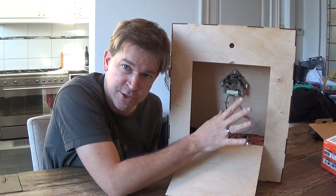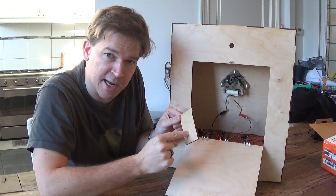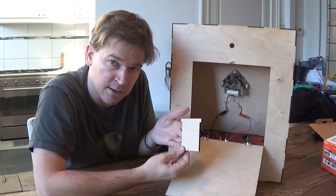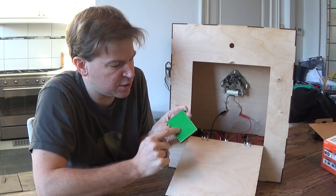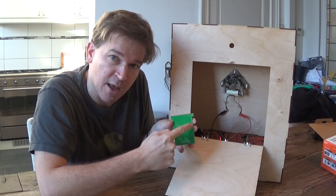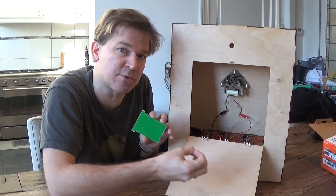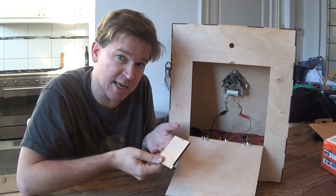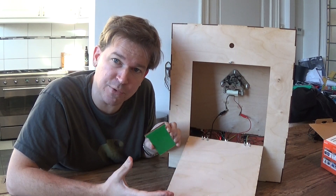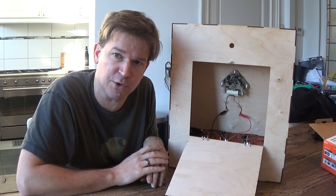Every slit has two sensors. First is a simple light barrier — the moment a key is put in, light is blocked to the sensor, so we know a key is there. Each key also has a little magnet, and each slit has a hall sensor that detects the magnetic field at the location where the magnet should be. That way we can detect if the right key is in the right slit. We visualize everything using red and green dual-color LEDs. Power comes from a simple power bank so the device can stay closed for more than an hour.